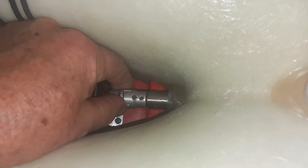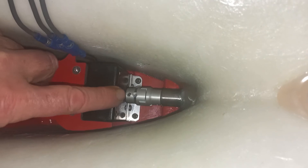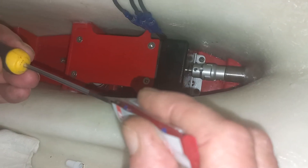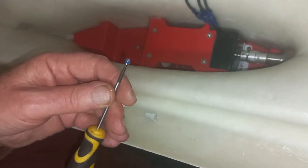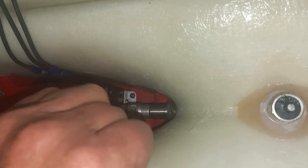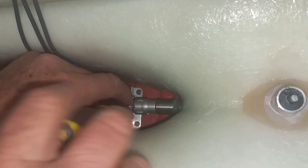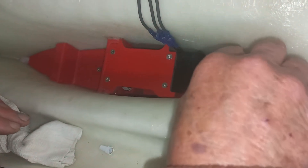When you pull it out, that's it — that's the gap you should have, thick as a blade. You would now fit the other grub screws, so with that one holding the coupling where you want it, you can drop your Loctite in the hole and put the next grub screw in. Put a drop of Loctite — it's the 242 version that we use — because you want to be able to get this out sometime in the future. If you put the stronger ones on you actually have to heat it up and you can't get the heat to that point, so 242 is the correct solution. Lock that one into place. When you're happy with that, come back to the first one, remove it, and fit the next one. There's no other way. If you use the vernier and save the measurement you might have been able to do it outside the boat, but that is just the way it is — there's no other way to do it.